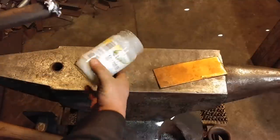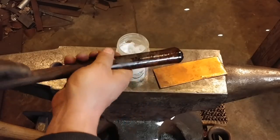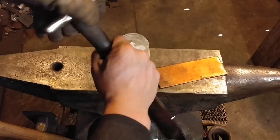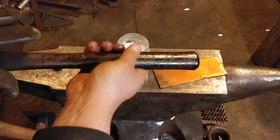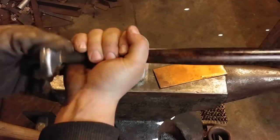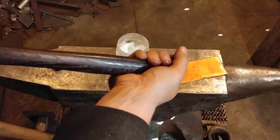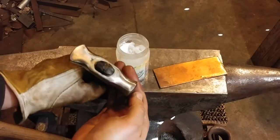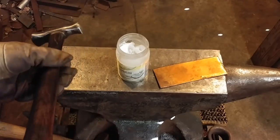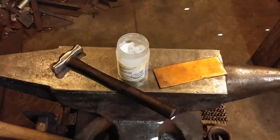This hammer is tougher than mild steel would be, and a little tougher than maybe a 10-series steel, so all I'll be working with it is copper — soft polished copper. I won't be using this hammer to hit anything like hot steel, cut-off tools, cold steel, or high-carbon steels of any sort. This is a great point: you do not always need a glass-hard hammer. Steel selection can be based on your need — you don't always have to go with 5160 or 4140; you can get away with a lot of different options depending on what you're working on.